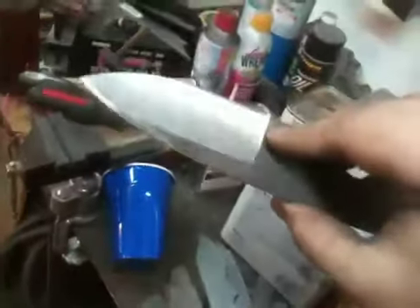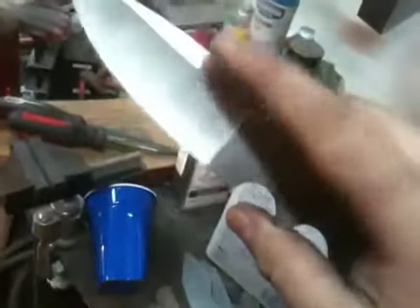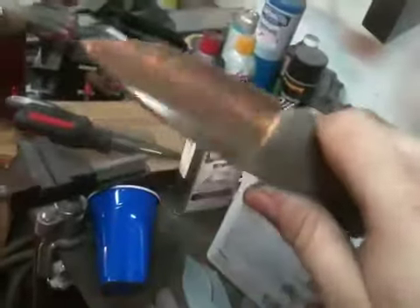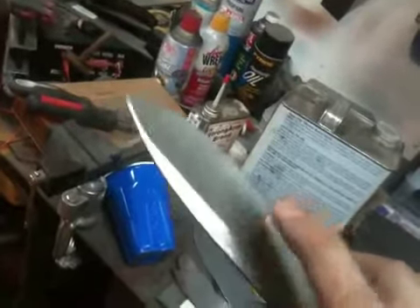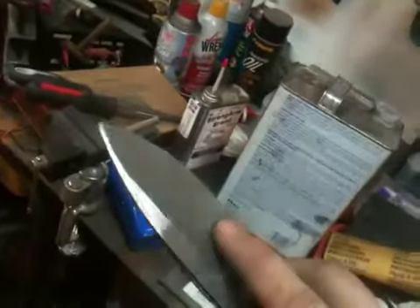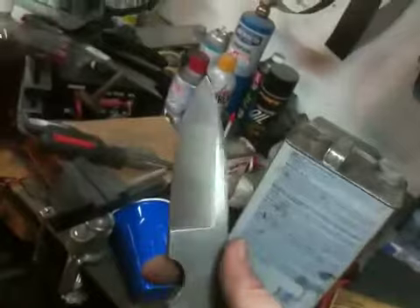I did get a little daring and put a little swedge on there, which will need a little bit of adjusting after heat treat. I really don't want to mess with this blade anymore until the steel is hardened and tempered — this is just about where I'm going to want it. That's a full hollow grind, which means I really couldn't go any deeper with an 8-inch contact wheel than what you're seeing right here, otherwise I'd be removing more from the middle of the grind than the edge, giving poor geometry. We're right on the outer limits of that.